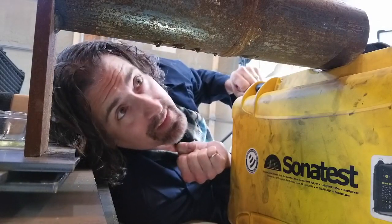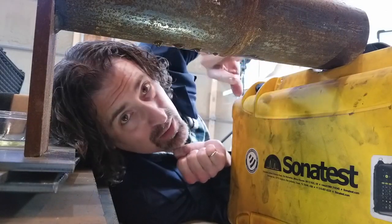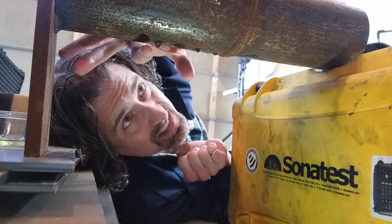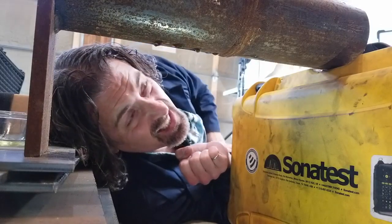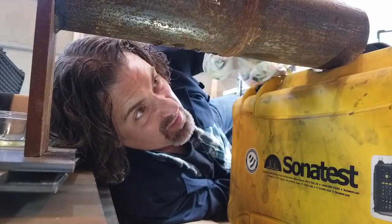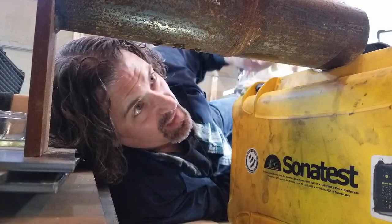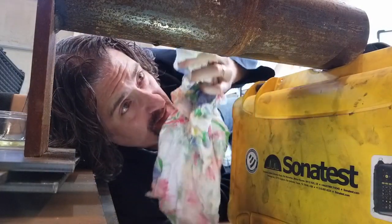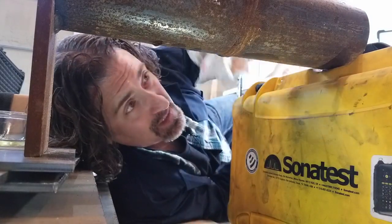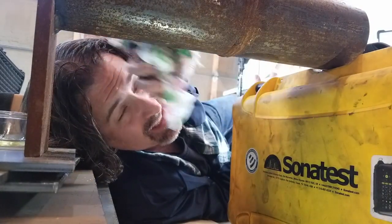We had our first drip. I was pretty generous with the honey but it's still holding on. The thin couplant over here would not work very well on the side of a pipe. The middle ones are all good. The honey is just too sticky. For the post-clean: the one mixed with washer fluid is easy to clean off because it's not very viscous. The first and second normal couplants are totally fine — the second may actually be easier. The high viscosity couplant is about the same as the first normal one. And the honey? Pain in the butt.